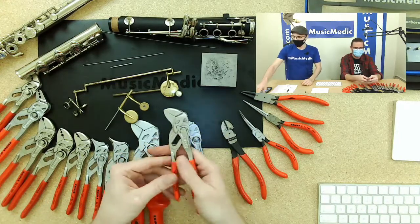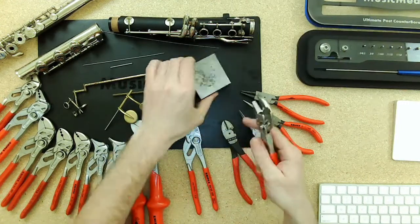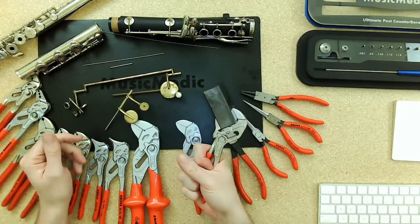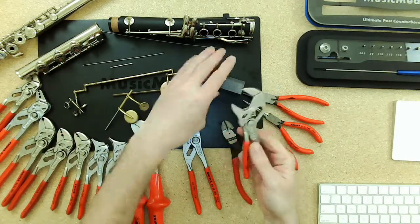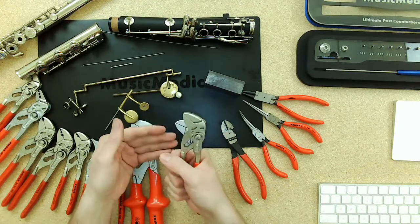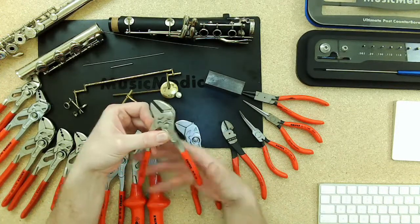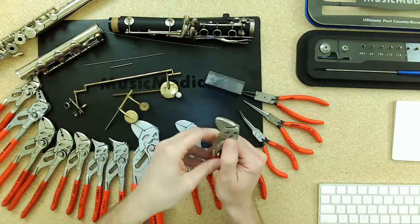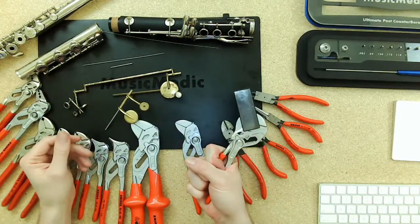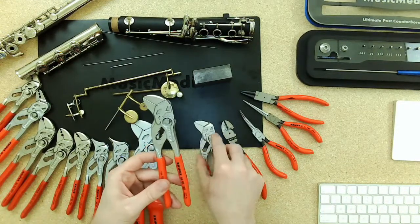The jaws are incredibly strong. With the smaller parallel Knipex, you can hold onto a steel bench block. The nice thing about Knipex is the handles — you can adjust them so they're nice and close together where you get the maximum grip. If you're trying to grab something with a big wide jaw opening, you don't have as much hand strength. So here you can adjust the tip opening while keeping the handles close together. Those are the small and medium Knipex pliers we have on the website.